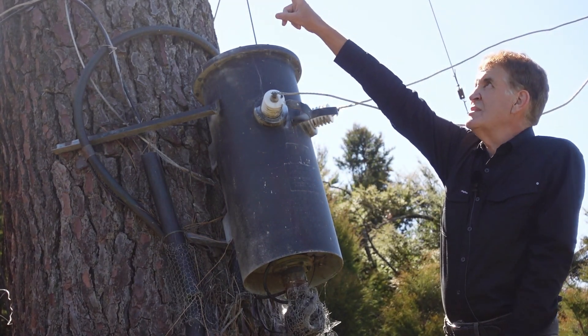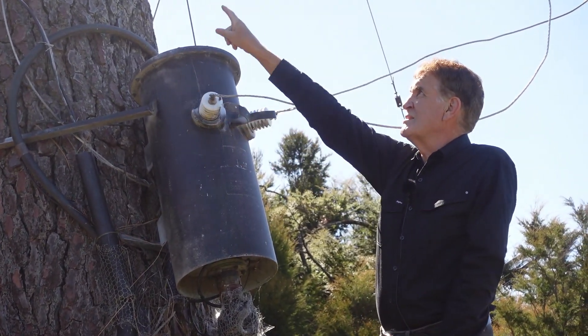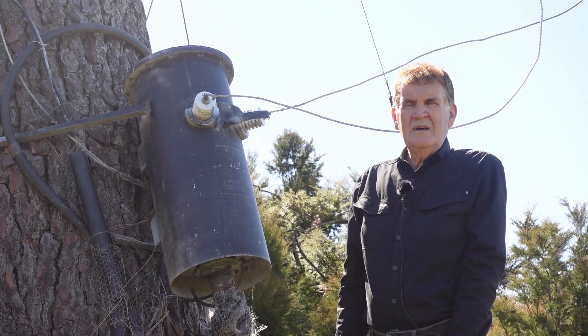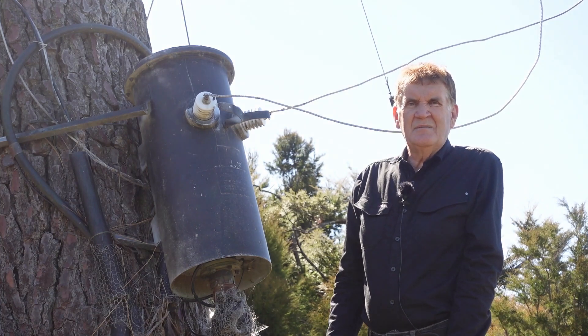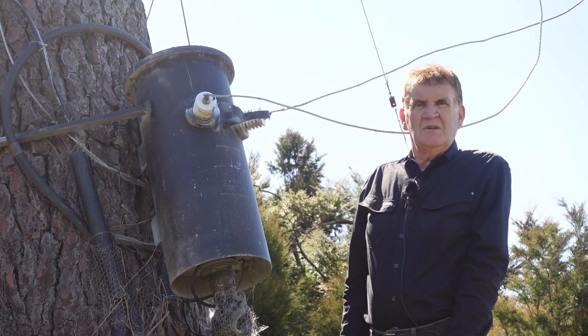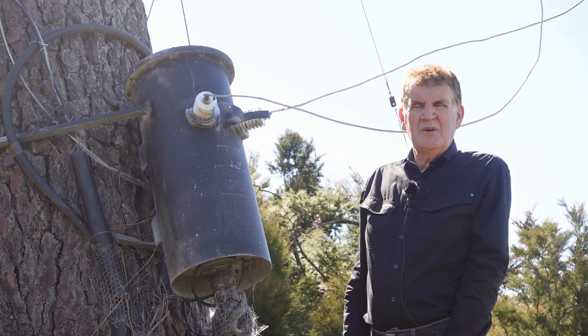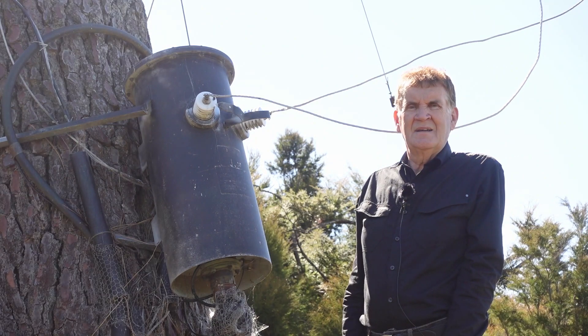Your losses would be much lower than if you were using coax — particularly RG213. On 10 meters or higher you're going to find losses really accumulate. I've got a half-wave up on that tree over the other side here — that's probably another 150 meters further up the hill — and I'm just using RG213. It runs a kilowatt no problem, so that's what I use for that one.